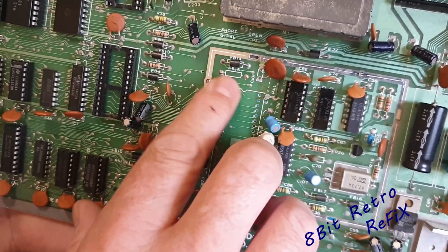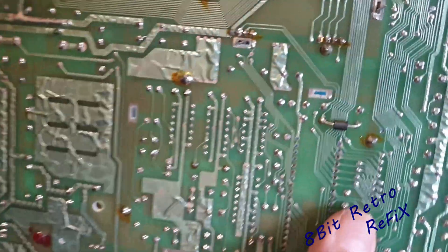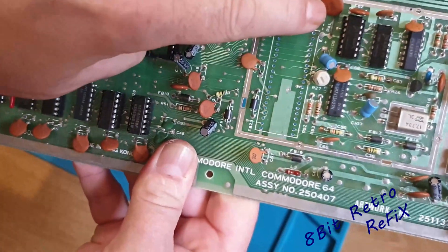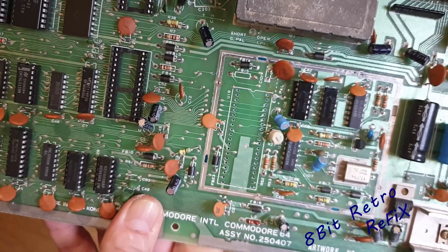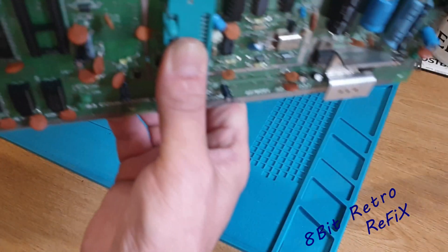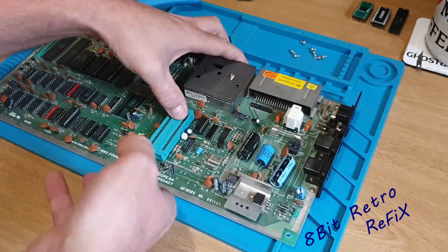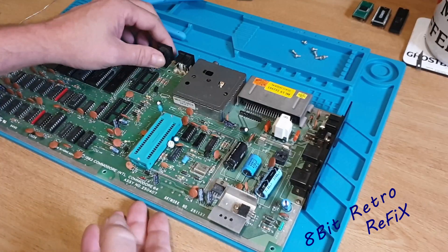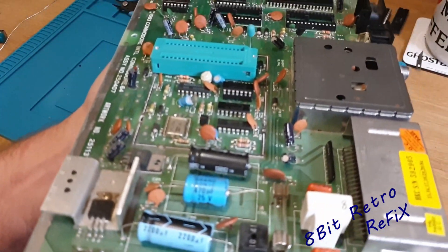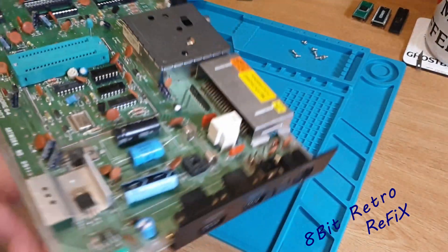I've moved the diode — pushed it through and soldered it from the other side so there wasn't too much solder on this side, then nipped the legs off. You can see that's been soldered in there — just to move it out of the way. This capacitor I was going to move — I've just bent it down out of the way a little bit and it looks like it'll just do. So I'll leave it as is and try the ZIF socket in. As you can see, it's gone down nicely — all flush all the way around. So I'm going to solder that in now and that should be the first ZIF socket done.